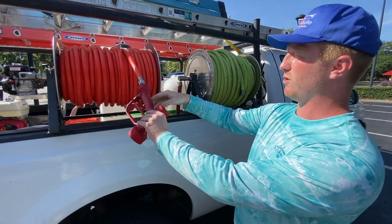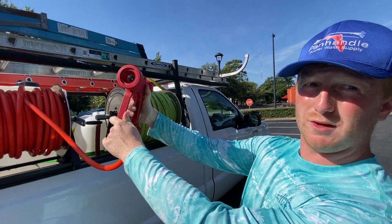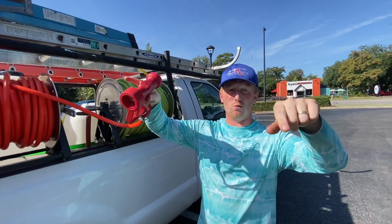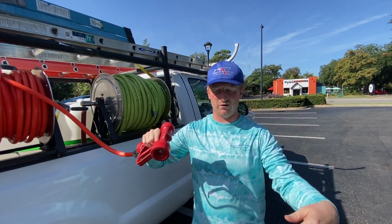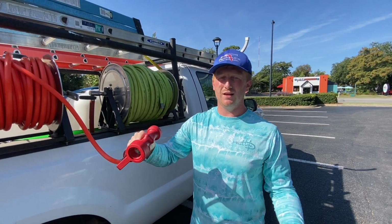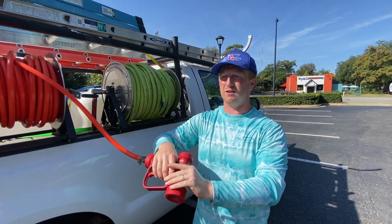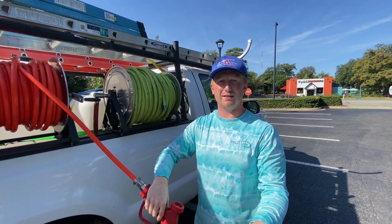We got this cool thing, it's called a wash down gun. It's got this circular pattern in here, so when you pull the trigger a little bit, it does like an O pattern, right? If you just spray it in a loose pattern, it's basically like a fan tip. And then as you pull it further, it makes that hole tighter. Without switching tips, it can save time.